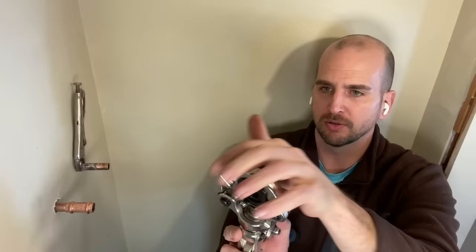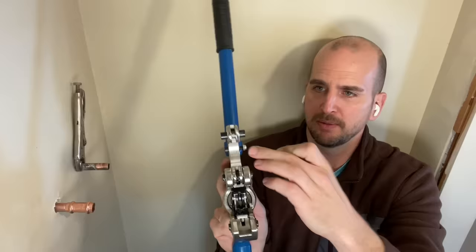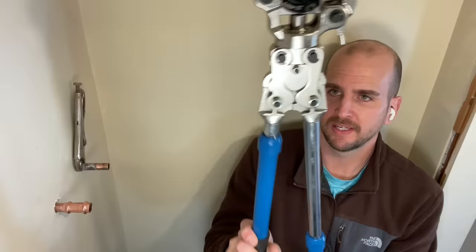The main features of this tool: it can rotate 90 degrees to different angles depending on where the fitting is and how you need to crimp it. The top pops open, allowing a pipe to pass through so you can secure the tool over the fitting and cinch it down. Swapping to the three-quarter or one-inch adapter is easy — there's just a push-pin in the back. It also has telescoping arms, so if you have plenty of space and need more leverage, that comes in handy.